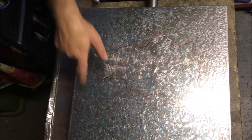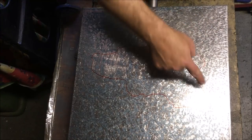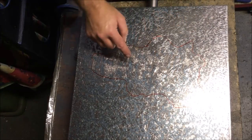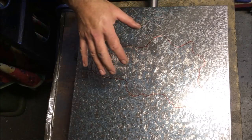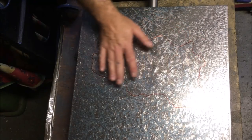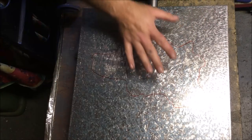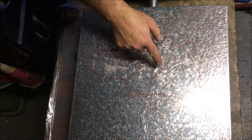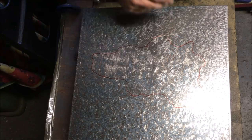Been educational. I've just done a print, a few minutes ago, because I've just scraped all that section. The middle area in the red, it's printing, but it's very widely spaced. When I was walloping it down, I've obviously leaned a bit harder in that area. So I'm picking off the blue progressively, but I know that in that section, when I take the blue off, I've got to be much lighter on my depth to scrape.